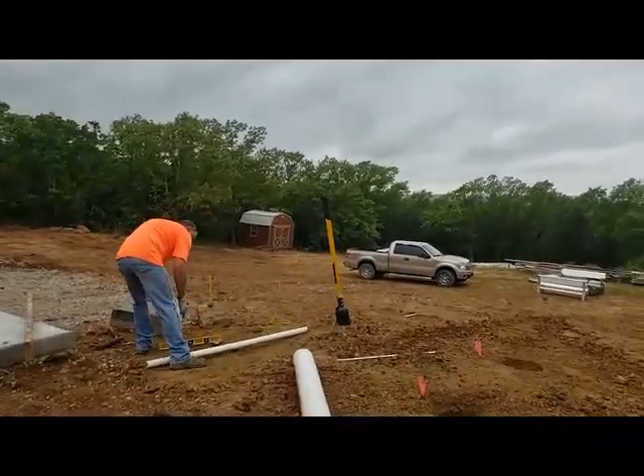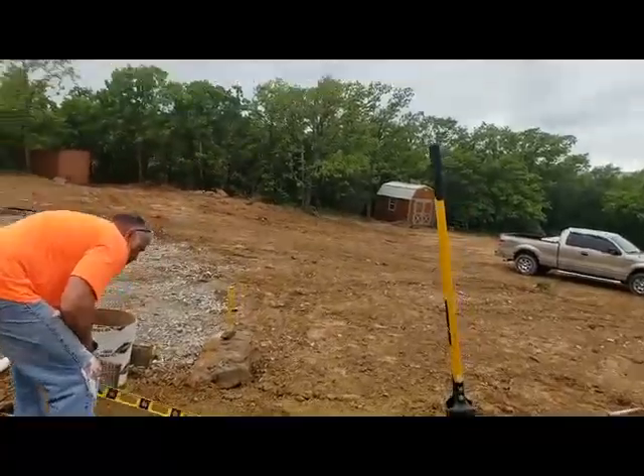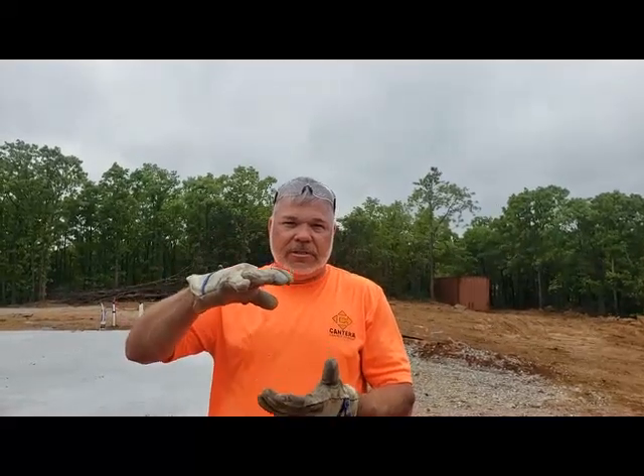What consistency are you looking for? It's really about workability. I'm watching that barrel turn, making sure I've got a good consistent rotation — no clumps, but no liquidy spots either. If we were putting this down on paving, I'd look for the same thing. You can do a slump test, which is how much it'll hold and stand up on its own. Too much liquid and it dissipates, all the aggregates go to the bottom. Too dry and it doesn't smooth out. For piers, adding the exact right amount of water to the concrete will be perfect.